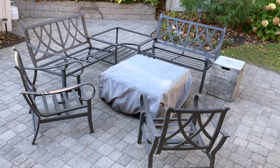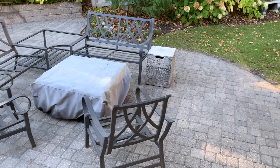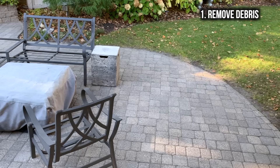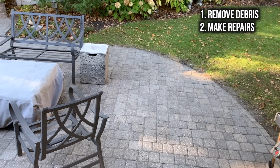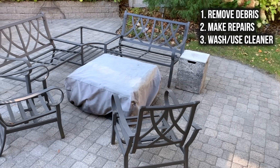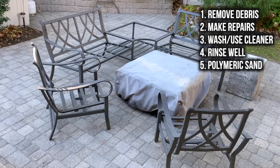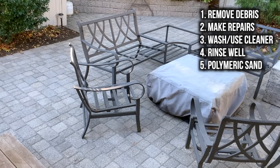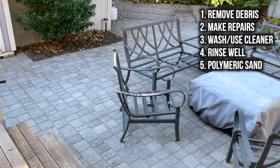In case you don't want to watch the entire video, I'll start by summarizing my process, although I do offer some helpful tips so you may want to stick around. You first remove the moss with a putty knife or pressure washer, make any needed repairs to raised, sunken, and sagging pavers, put down 30 Second Cleaner to remove years of staining, power rinse it, and finally fill the joints with polymeric sand. See the information section below to jump to a specific point in the video.